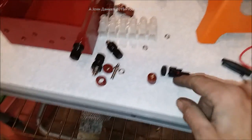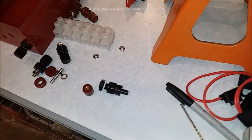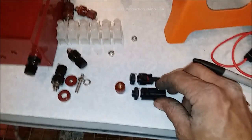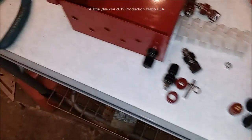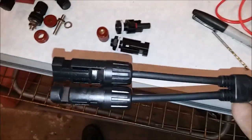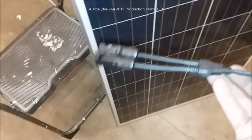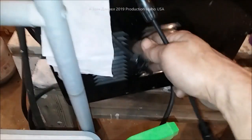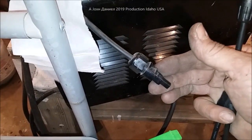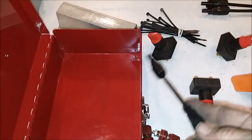You have two different types of fittings — here's where the male fitting goes and here's where the female fitting goes. Say you join a pair of panels: you take two panels and combine them into one 10 gauge wire. Then using your wire coming from up top, wherever you're running them from, you'll bring that down and plug that into the box.